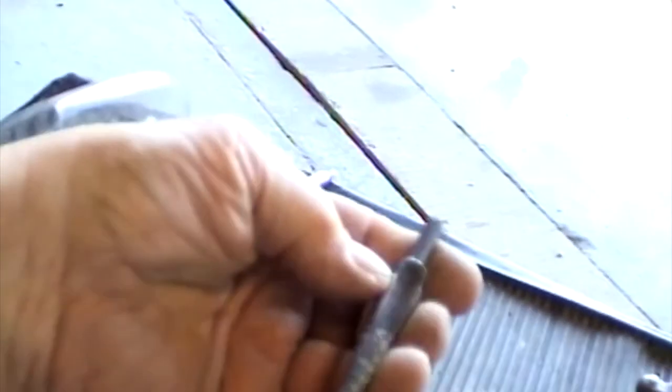And we've got Clecos, an X-Acto knife, a razor blade, a Swiss Army knife, and a hammer. We have a Unibit. This comes in very handy, and it's virtually impossible to install these things correctly without using one of these. And it's very important that it's the type with only one flute down the side, not double. The doubles will walk on you.